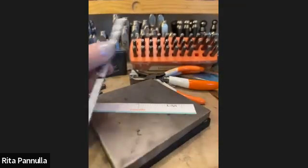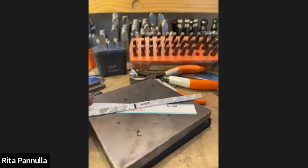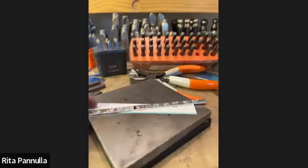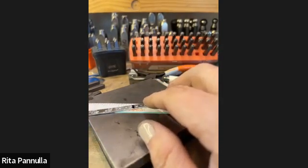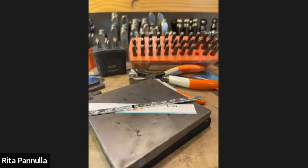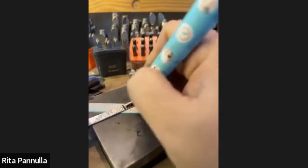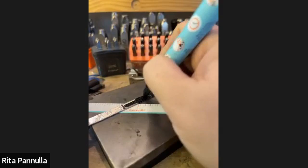Okay. Now I'm going to come out and I'm going to enamel. You want to always enamel before you bend. Okay. See that black line? You're going to keep that there. You're not going to take that line off right now. Okay. I'm going to come in with my black enamel. And I'm going to go over all of my impressions that I've stamped in there.